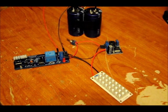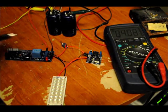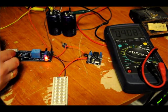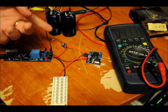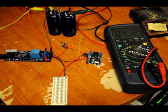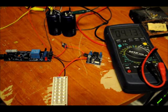I will stop the video and give you a demonstration. I've got my multimeter connected to the capacitor bank. I've got my 9 volt at 1 amp power supply here. I will plug it in. The LED blinks three times, the relay turns on, and charging commences. We've got a 200 farad bank, so we're charging these capacitors at a mere 500 milliamps, just due to the design — it's a slow charge. The power resistor does get a little bit hot, and I will be instructing you to keep it at least one centimeter above the board.